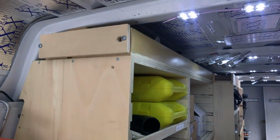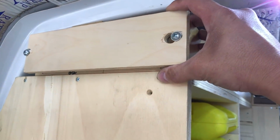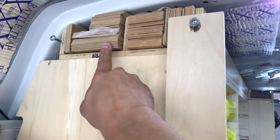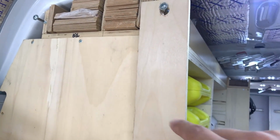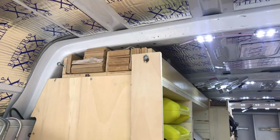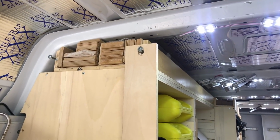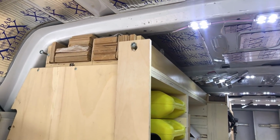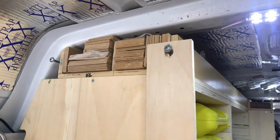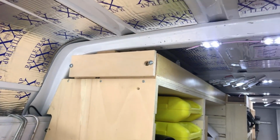Okay, at the top of these cabinets I have a long box that holds this material. See, I apply everything that you say, trying not to tie everything up and keep easy access. This is 1/8 cover sheets material that I ripped down to 2.5 and 4 inches. I use that to make templates, like a countertop template if I'm going to install a countertop between 3 walls, or if I am doing mirror frames between 3 objects. It could be between 3 walls or between 2 walls and a cabinet. Whatever it is, that helps me go really quick and accurate with my scribing. So that keeps it from sliding out when driving.